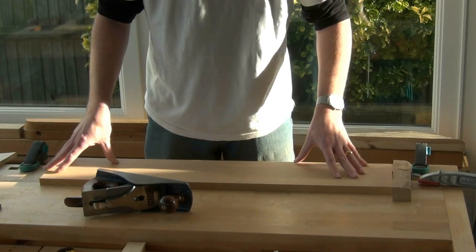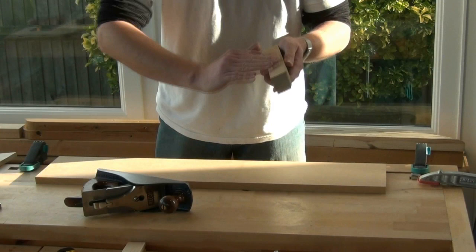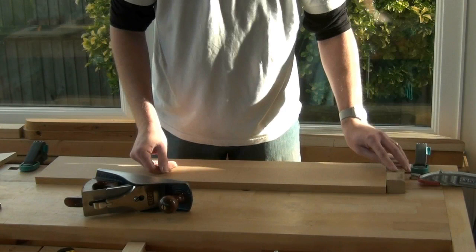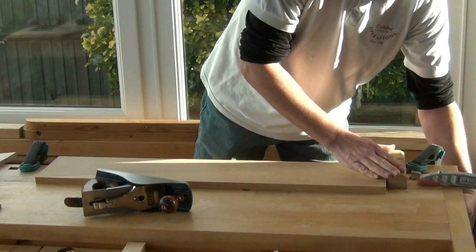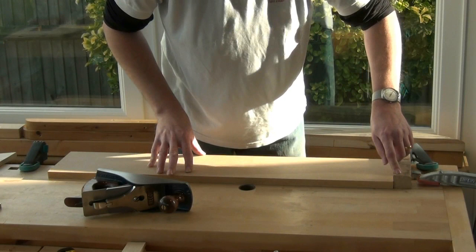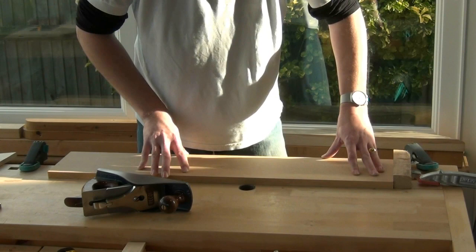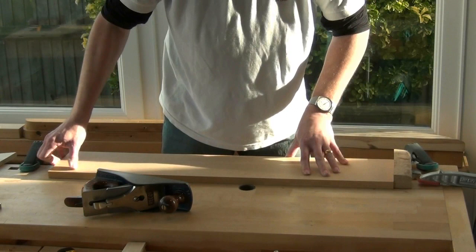That goes down on the bench. At one end of it you want a block of hardwood — just needs a flat face on it and roughly 90 degrees to the base. On my bench I'm putting that up against the bench dog and then the MDF board up against that. I hold the MDF a little bit forwards of this block at the end so the block won't get in the way. Because we're going with the grain, tearout won't be a problem. Press that all up against the bench dog and then clamp the board to the bench.